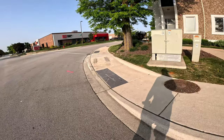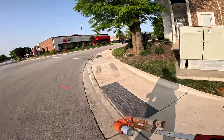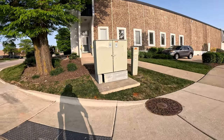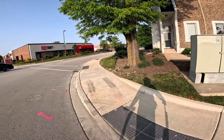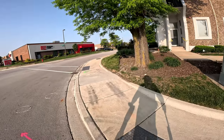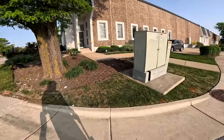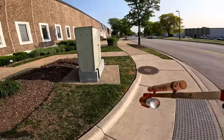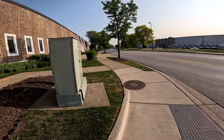Just because this cable, this run, went underneath some Comcast lines and Comcast pads — that doesn't mean you're bleeding out to Comcast. I had a good peak response, good null response on this cable, and it took me right into the manhole just like the equipment shows.